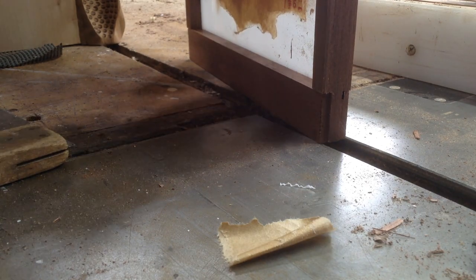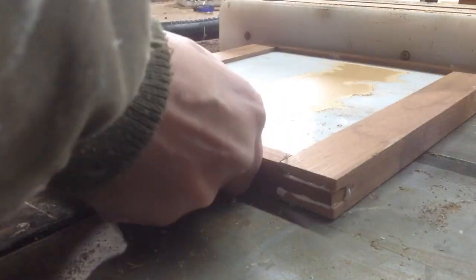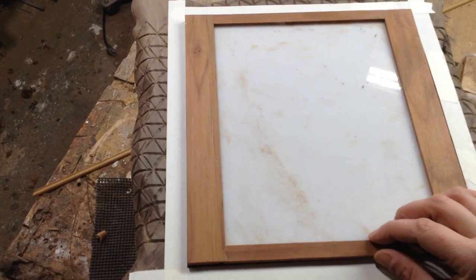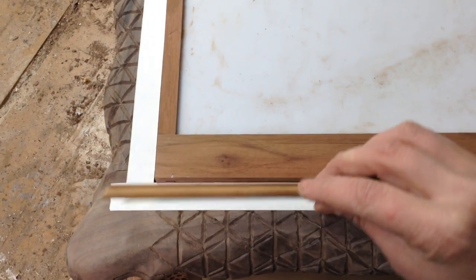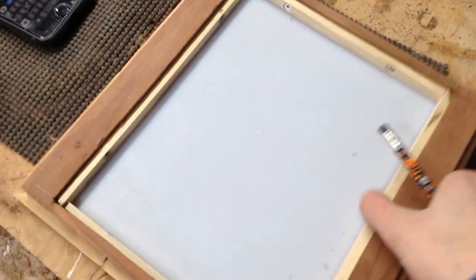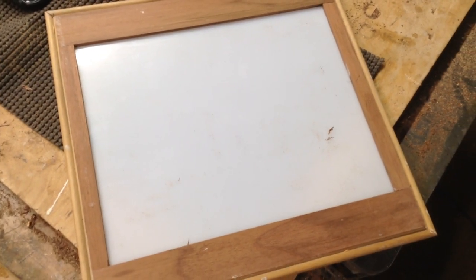In this case the person I'm making this for may want to change it out, or if it breaks it's much easier to do. You can see how it slides in there — I only put glue on the edges, and then this whole lid fits inside the groove in the box. I trim out the edge and that's the lip that sits on top. That's what it looks like if you rabbit that inside edge and put some scrap in there to hold the new plexi in place.